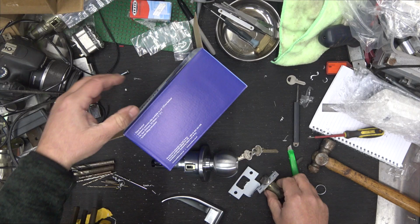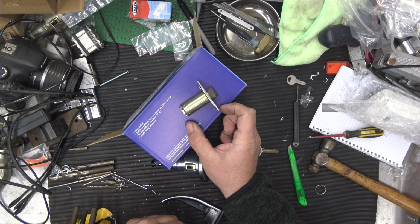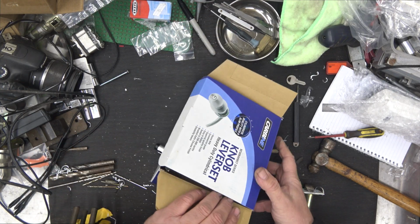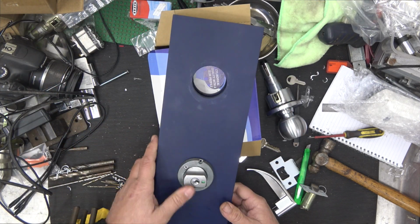If you need a 127mm latch, that is this part here. This is a 60 configuration. There is a shorter one, which is a 70 configuration. The next one is a 127. So there's three choices. I'll show you what back set and configuration is now, just so we don't forget to cover it.